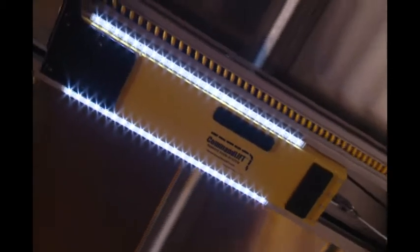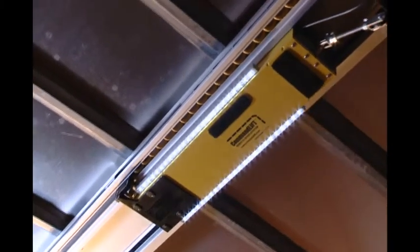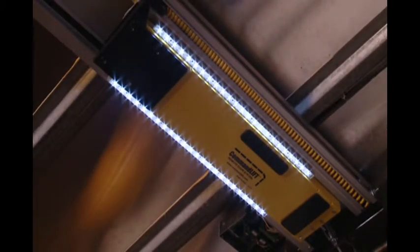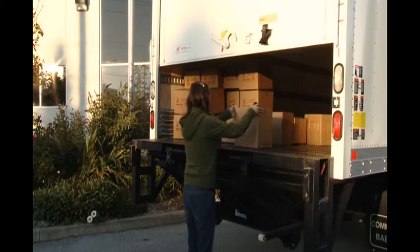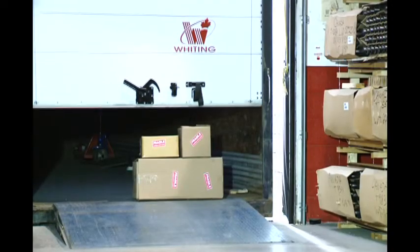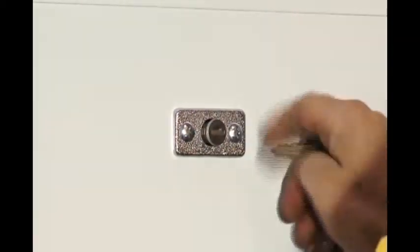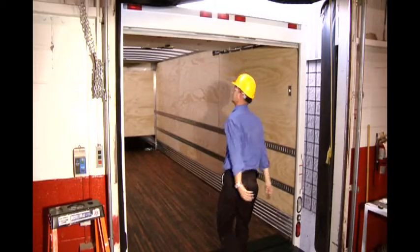When the remote control button is pushed, the Lumabar LED lights on the Command Lift motor will turn on and the door will open. With the door open, these lights will stay on for 15 minutes unless the button is pushed again. When pressed again, the door will close and the lights will stay on for one minute. If the button is pressed while the door is traveling up or down, the door will stop; the next press will travel it in the opposite direction. If the roll-up door hits an object while closing, the door will stop and back up approximately six inches, allowing the obstacle to be safely removed. In the absence of power, insert the key provided and turn it to release the lock cylinder, then pull the cable firmly to release the motor unit from the track and allow the door to operate manually. Likewise, from the inside, you can pull the emergency release cable to release the motor unit from the track.